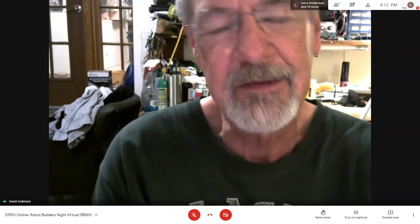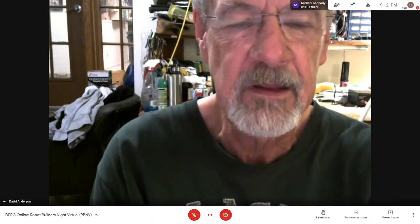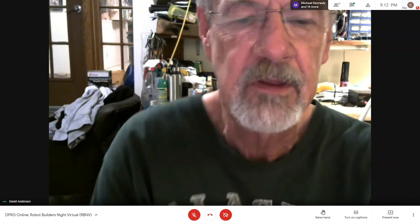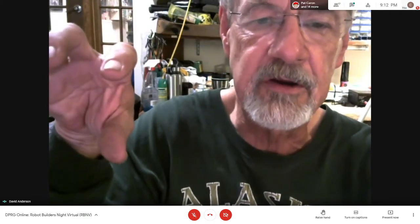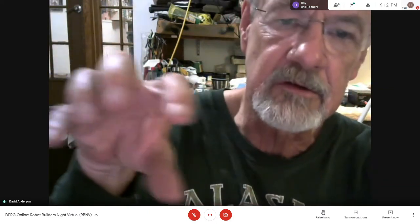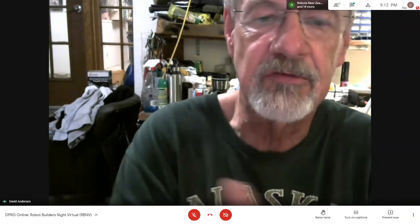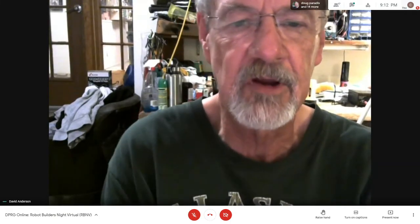We had on the radio control camera car that we used to drive around SMU, the camera itself on an XY mount. So when you steered at high speed, the camera would actually tilt in the direction you're steering and look down a little bit so you could see corners and see what the wheel was going to hit. The camera was just steered, and we did that by mixing in the transmitter.